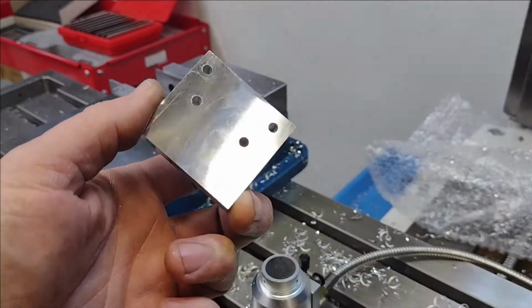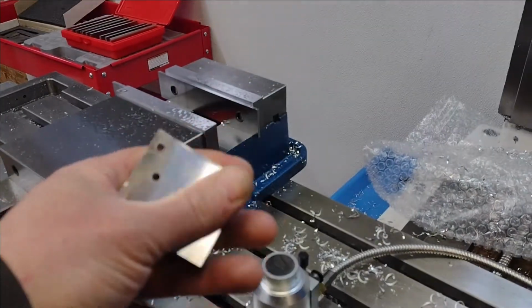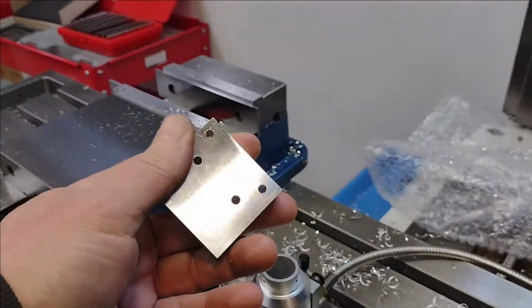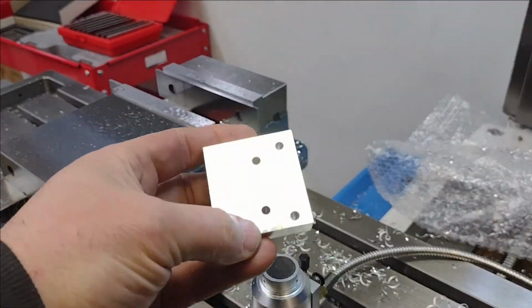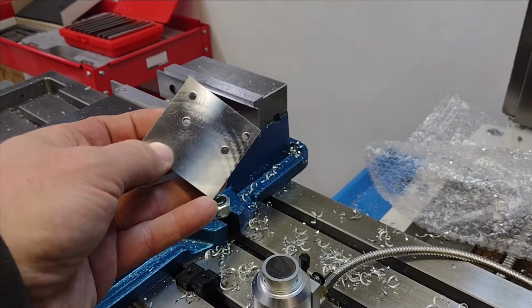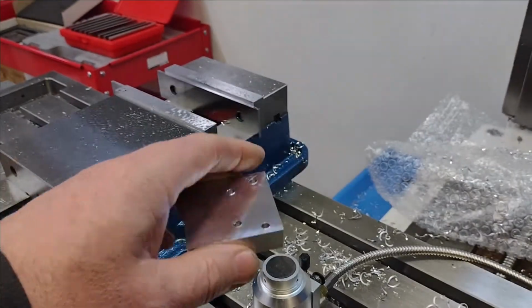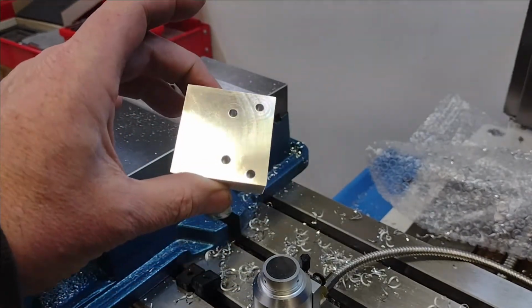So here's the other side of those holes. You can see some scratches along the edge. Those are from the parallels, because I'm tapping this thing down. This is going to be a working part on the lathe, so no big deal, but there's the finish, there's the holes. So I'm going to use these holes to hold the part down so I can mill the perimeter